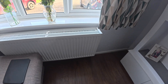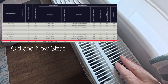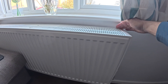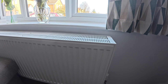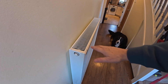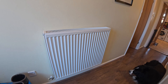As part of your installation you're probably going to need to replace some or all of your existing radiators. As you can see here, our front room radiator has been replaced with a large three-panel radiator. It was important to us that it fitted into the existing space underneath the window, but to get the heat energy required it needed a much deeper radiator. Originally we had a single-panel radiator; we've now gone to a triple-panel radiator. Here in the hallway we already had an existing double-panel radiator, but as you can see we've gone to a much taller model. This allows us to get the heat energy required to heat the house and make sure that every room stayed consistently warm.